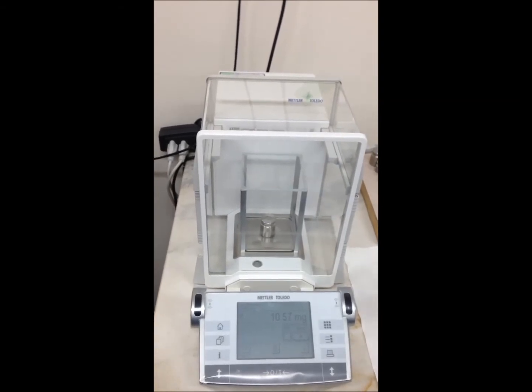What this tells me is that this customer's weight is 10.58 milligrams heavier than our standard. Our standard will have a correction factor too, so the actual weight after we do the calculations will probably be about five milligrams heavy, which is well within tolerance.